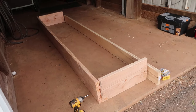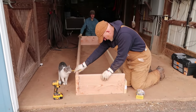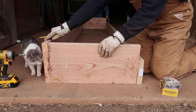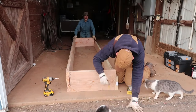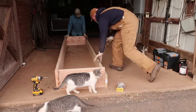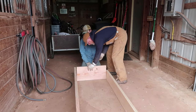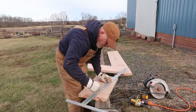On the sides we have two-foot lengths cut from a 2x12, and on the back there is a ten-foot length cut from a 2x12. On the front there is a ten-foot length cut from a 2x8. In order to make an angled lid, you simply draw a straight line from the back to the front to create that angle, making a mark where the front board meets the side length, then use a saw to cut along that line.